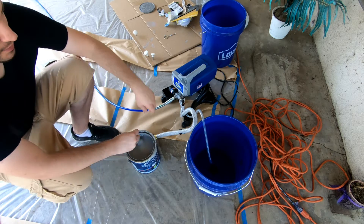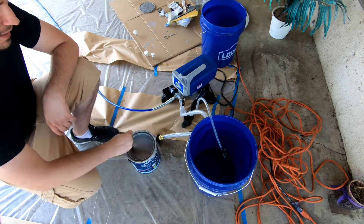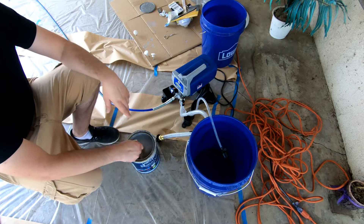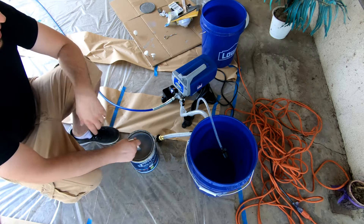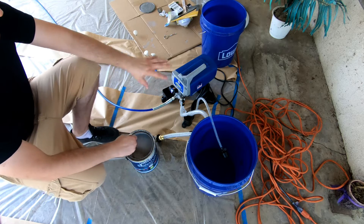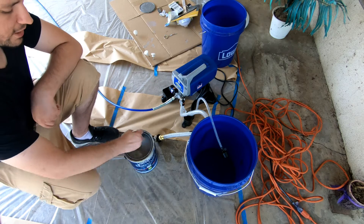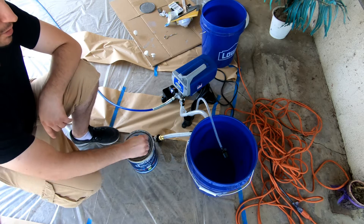When you're done painting you can hook the water hose up or put it in the buckets and do the same priming method to get paint out of the gun. Flush water through it, then flush mineral spirits through it the same way to fully clean out the gun. After the mineral spirits run water through it again, then put in that blue solution that comes with the machine - hook it up with the nozzle, squeeze it, fill it into all your valves, and stow it away.